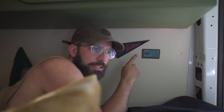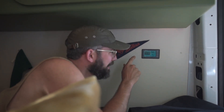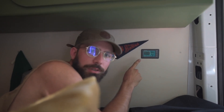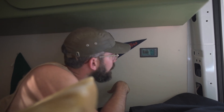This little guy here is a battery monitor. We have a shunt down below on our negative cable from the battery to the ground. From the shunt, a wire comes up to this battery monitor and it tells us exactly how much battery we have left. Right now it's blinking because we're charging, so it's basically telling us that we're getting solar power.